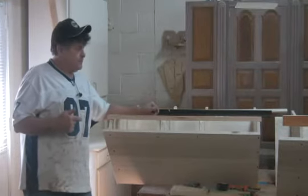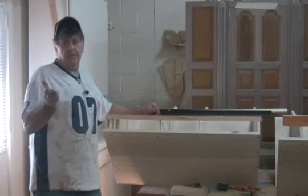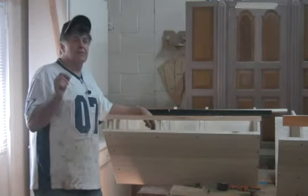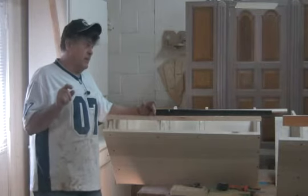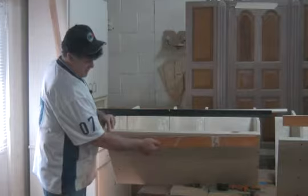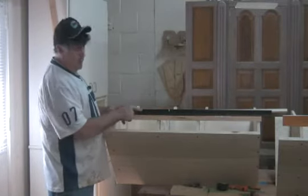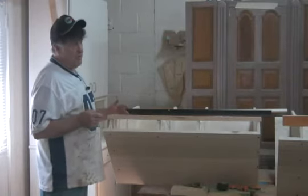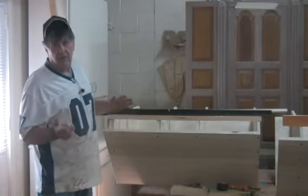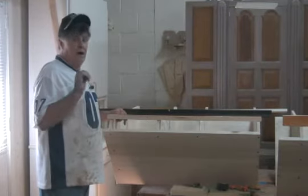So, what am I going to do? Like I said, the simplest thing for me would be to put it across the jointer, take it on down to about 3/4, strong 3/4, and move on. But I don't want to do that, because you may run into this yourself. And this has got to be pretty nice. What I was doing was laying out for the mortises to show you. But then this side of it, I've got to cut that 22.5 degree on. So it needs to be pretty straight. Once I get it into my side and get it glued, and then get it attached to the case, it's not going to move anywhere. Holding wood is a lot easier than moving wood. So what am I going to do? I'm going to show you. All right.